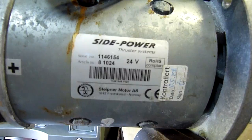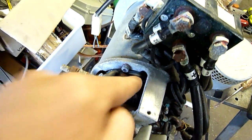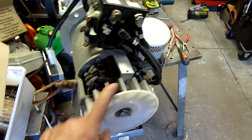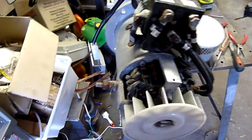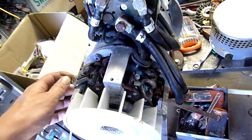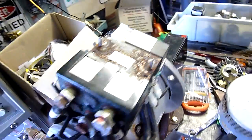So there's the main dates there. It's had a bit of salt water sprayed through it — everything's a bit rusty, the springs are still intact. I've examined down inside it with a bright light and none of the commutator bars are actually burnt, so it didn't sit locked up burning, it just stopped. It probably ran for a while; the brushes obviously couldn't move, and it ran and ran until it wore the brushes away and just lost contact. It's got 4 pairs of brushes, reversing contacts on top. Everything's been doused in seawater — probably had a seal failure somewhere — and it's just killed the thing.